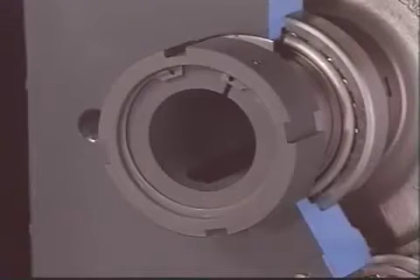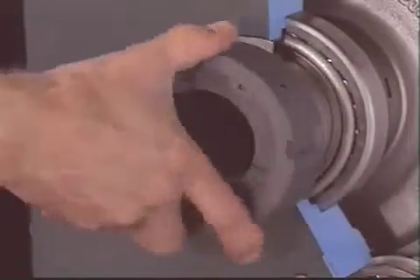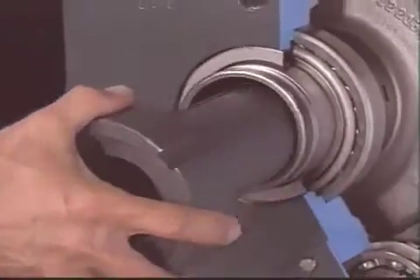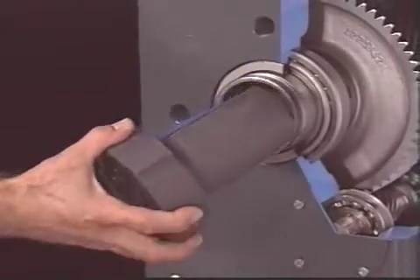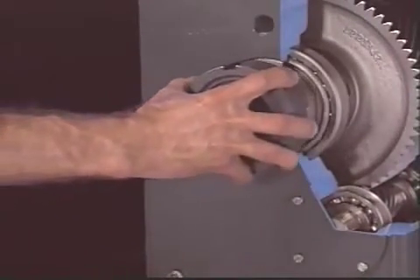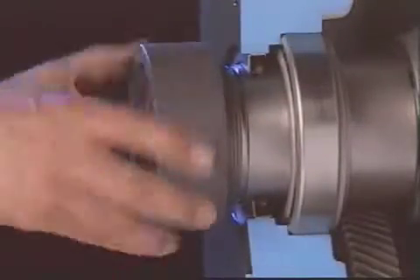The heart of Falk's new quad-drive shaft mounting system is Falk's unique TA taper — all ductile iron and center relief. The Falk TA torque-assist taper is fitted to the unit output side. When the threaded bushing nut, secured to the taper with a snap ring, is turned, it smoothly and evenly draws the bushing taper into the hollow shaft bore.